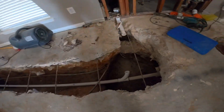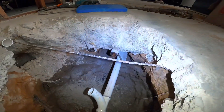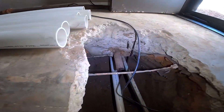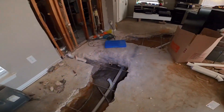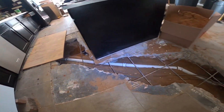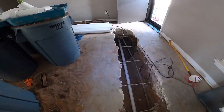When we did, we found that the old cast iron was actually ran through the beam — right up in that area right there, and through this beam right here. So what we did was we excavated starting here and went up under the beams, which caused us to have to lower the drain line.